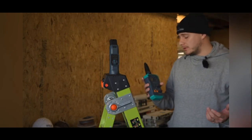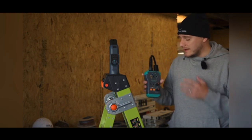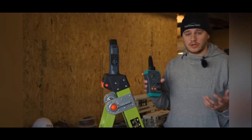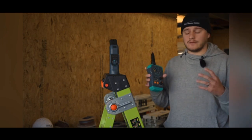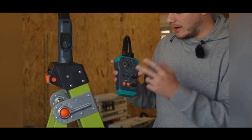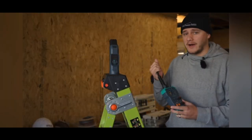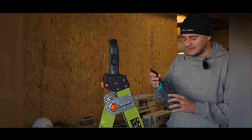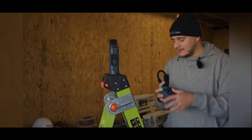Q-TEC is no stranger to electric vehicle charging. The Q-EVSE adapter has been out for quite some time. It's a fully featured electric vehicle charging point test adapter. It comes with all of the industry standard features: three phase, CP error, PE error, a touchpad, and it can also be connected to an oscilloscope for further in-depth diagnostics.